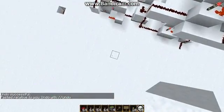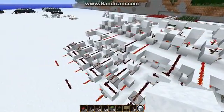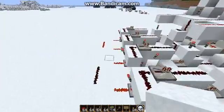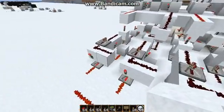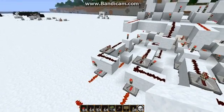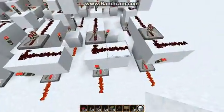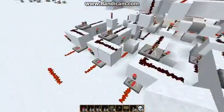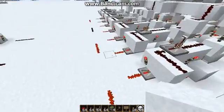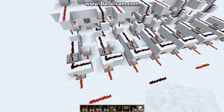All the outputs of our D flip-flops are plugged into the inputs of the ALU. Now, the reason we're doing this is a little bit odd. Basically, every other one is going to correspond to the input. This is the first digit of input A, the second digit of input A, the third digit of input A, the fourth digit of input A. This is the first digit of input B, second, third, fourth. And that's the way this is going to work.